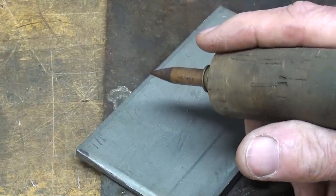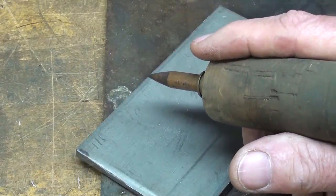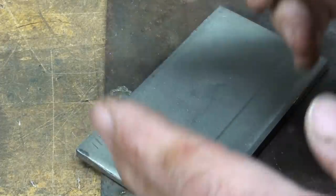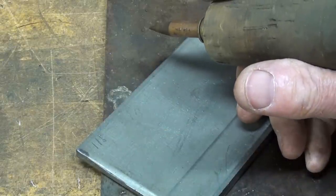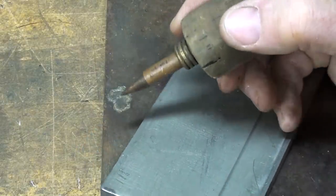So let me give it a try here. Don't expect my handwriting to be too great — I've got this on the high setting and the number zero tap. The interesting thing about etching is it does not care whether the metal is soft or hard. This is just mild steel here, but you can etch hardened tools, so that's one of the big advantages of it.